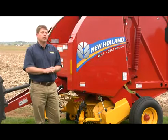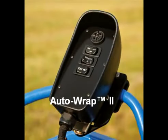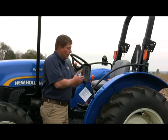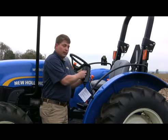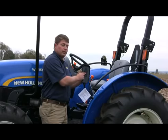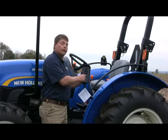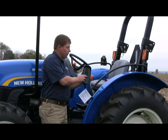Let's take a minute to take a look at the controls. Our basic twine configured balers come with the Auto Wrap 2 controller. Auto Wrap 2 controllers basically give you manual and automatic function of the baler. It gives you three wrap positions so you can put high, medium, or low levels of twine on every bale with a flick of a switch, and you can manually extend or retract the twine arm to apply a little bit more twine if you feel the need to.